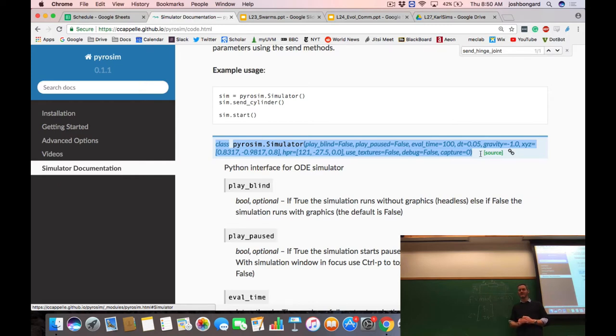Could do that. Just a thought, would it make sense to just get rid of the Z sensors altogether and put four touch sensors on each foot? Yep. Well, you have to just lift all its legs up. So we could abandon Z altogether and go for touch, in which case it'll probably get a millimeter off the ground and then land again.